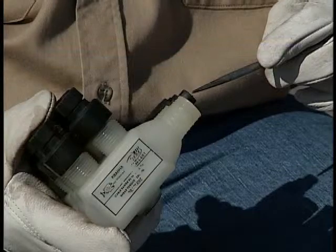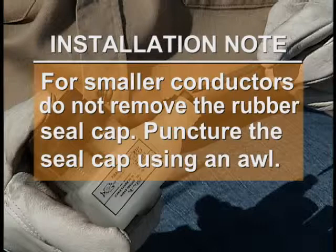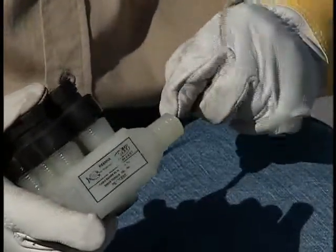There is one other installation note you need to know. For smaller conductors such as number six or number 12 copper streetlight type conductor, do not remove the rubber seal cap. Instead, puncture the end using an awl. But do not pierce a hole in the seal cap unless you intend to use the port.